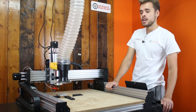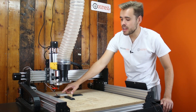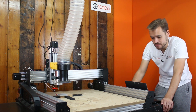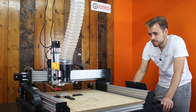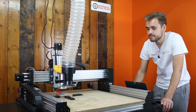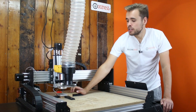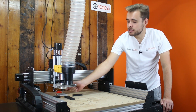To use these commands, what we need to do first is get the machine roughly over the touch probe, so I'm just going to jog the machine now and get it in position. I'm just going to lower the Z so it's closer. In the commands we've got, you can set up your allowances for the probe, so we just need to make sure that ours is inside this aluminium piece so it has enough travel to get to the edges.